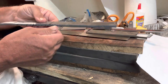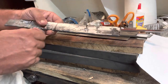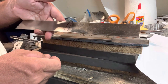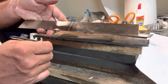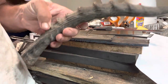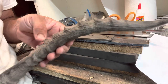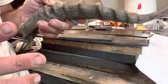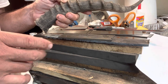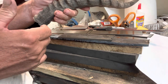I've got a better idea of what direction I'm going now. This is the twist Damascus — I'm going to cut it in half, putting it at just over six inches. I'll use 1095 for the core and a couple pieces of 15N20 to give a little more contrast. I've got the blade shape in mind, and for the handle I've got this piece — I believe it might be antelope horn or something like that — that was gifted to me. It's going to look cool and fantasy-like. I'll cut this out, grind it, clean it, stack it together, and also do a Damascus guard, forge welding both at the same time.